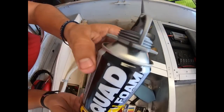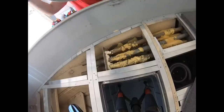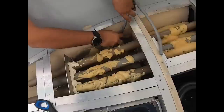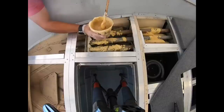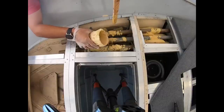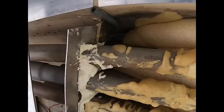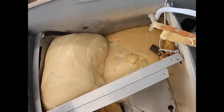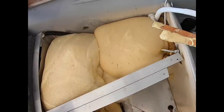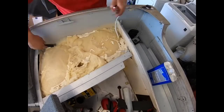I used quad foam to seal in the gaps so when we pour the foam into this pocket it won't seep down into places it's not supposed to go. I realized in gutting boat after boat that had old pour foam in it that pockets of saturated foam happened because there were no bleed-offs for water to go — so it just sat on the foam and compromised it. That's what will happen over time if you don't have a plan B. So what we did is run tubes everywhere we could, and we know that when we pour the foam it's going to mushroom — and the lowest part of the tubes is where the water is going to drain, so we just cut off the tubes once we pour.